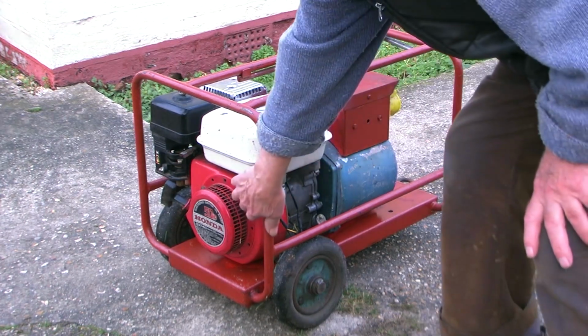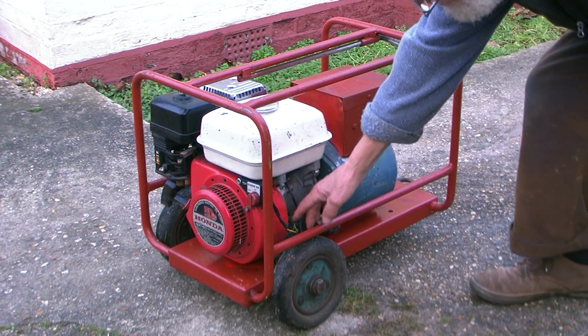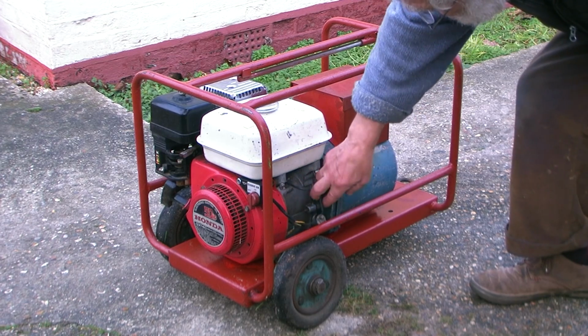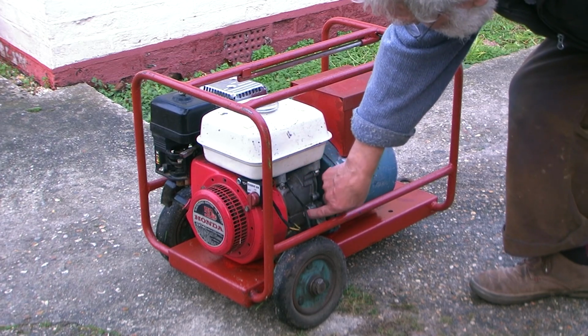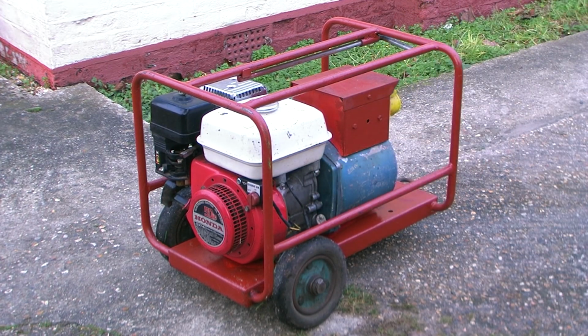Just here you have the off on switch, ignition off on. And in series with that switch there's a wire goes down here. One goes to deck as it's short to deck. And there's one going into the sump of the engine. And it transpires there's a float switch in the sump. And if the oil gets below a certain level, it shorts the ignition out, either the trigger coil or the charge coil, to deck. Hence no spark.